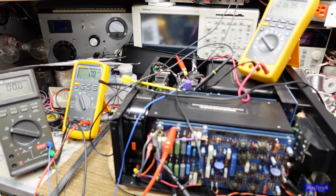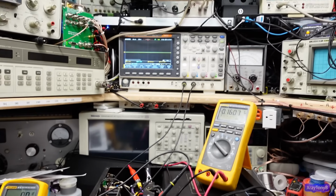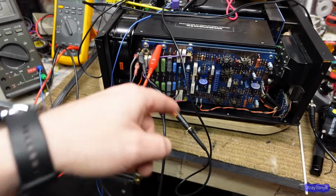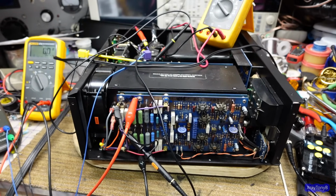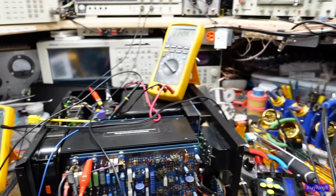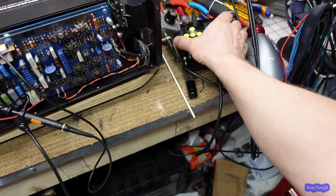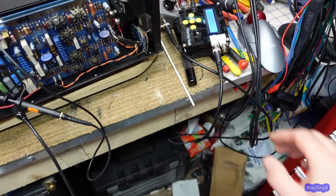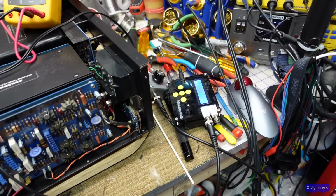That's what we're going to do. So looking at the bias, I have the oscilloscope connected to the two outputs, where the speaker terminals would be, and there's no load on there, so it's high impedance. And then I have my little portable signal generator, that I'll turn on. It's turned all the way down right now, and it's turned off.